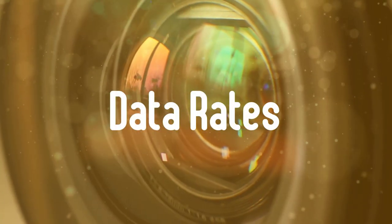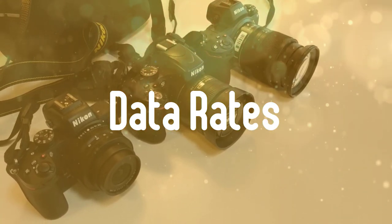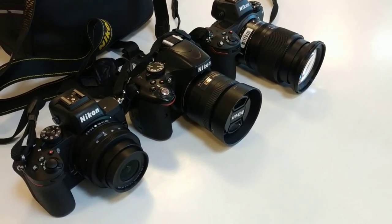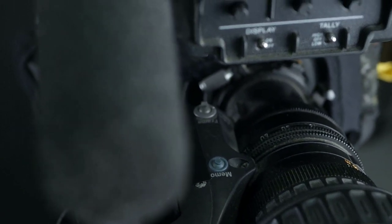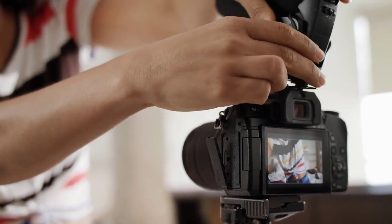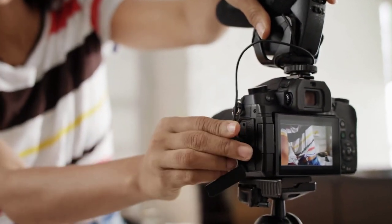Second, Data Rates. Just like your cell phone data plan, you don't get something for nothing, and even though capturing high-resolution imaging isn't generally a problem these days, when you start recording minutes of video at 30fps — or 1,800 frames per minute — this can take quite the toll on the camera. Even shooting at lower resolutions of HD and 4K, various issues can pop up, such as overheating and your camera shutting down, or dropping frames if your recording media is not up to snuff.